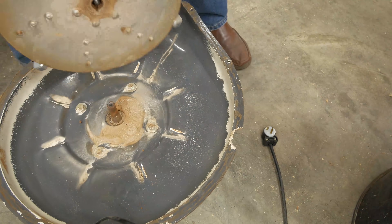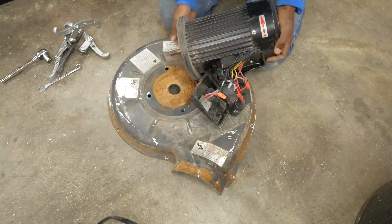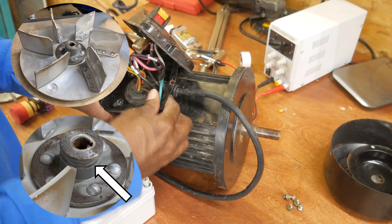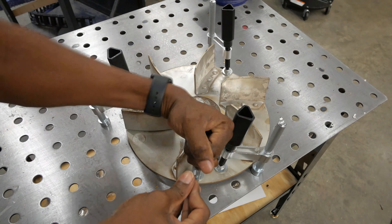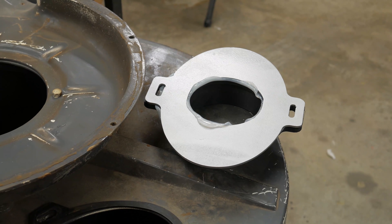In the spirit of taking it apart, I also decided to remove the impeller, clean the shaft, all that good stuff — and I bent the impeller pretty good while moving it. In hindsight, I can see that there's a groove cut into the collar of the bore there, and that would have been the perfect place to put my bearing puller. I briefly tried to bend the impeller back into shape, but that also meant trying to rebalance it, and I decided to bail on that plan and go ahead and order a new impeller.